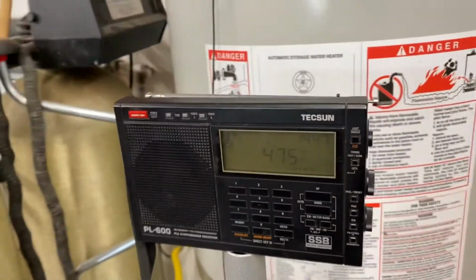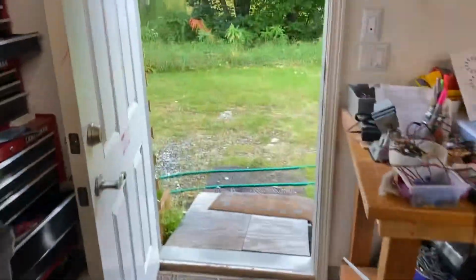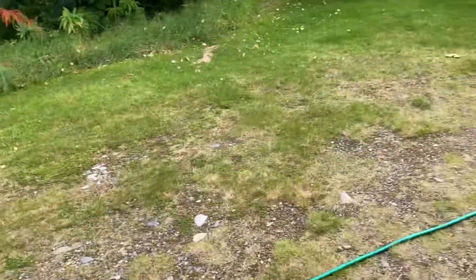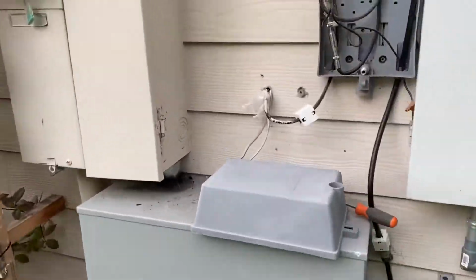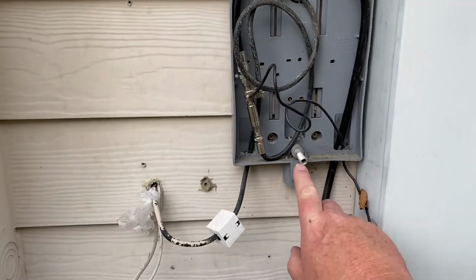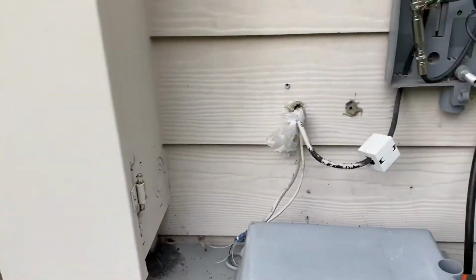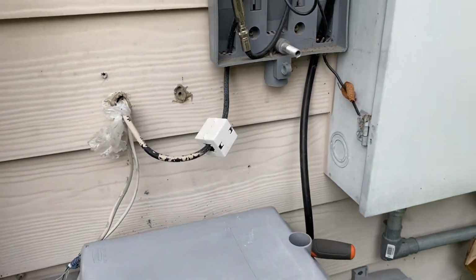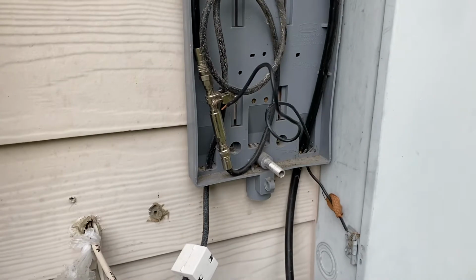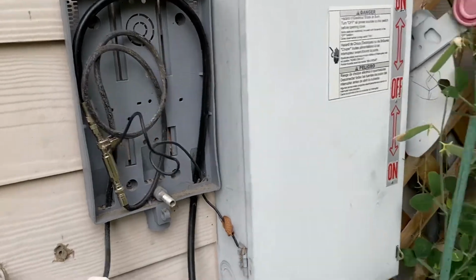So this took me about 2 weeks to figure out. So sometimes look for the least obvious paths. Don't break your safety regulations as far as AC bonding is concerned. In fact, they earth their coax at their box out there anyway. They've got an earth rod. But if you isolate their system from our earths here, in my case, it stopped the noise being superimposed upon the earth.